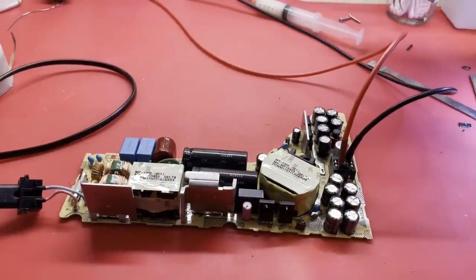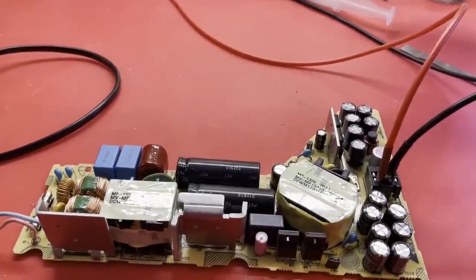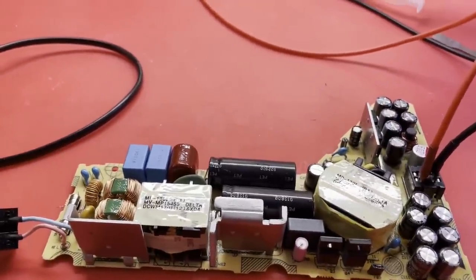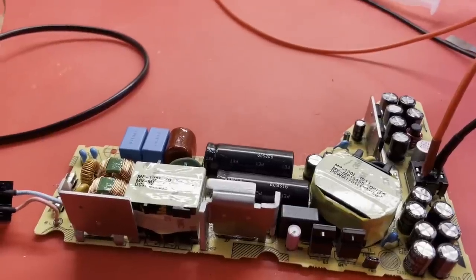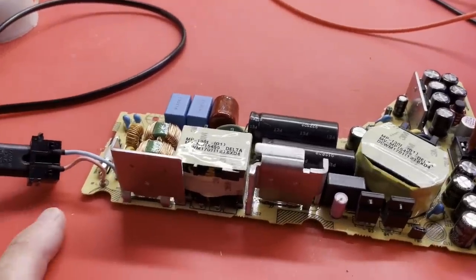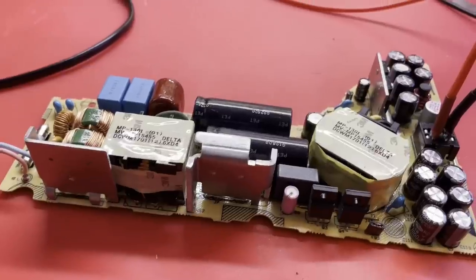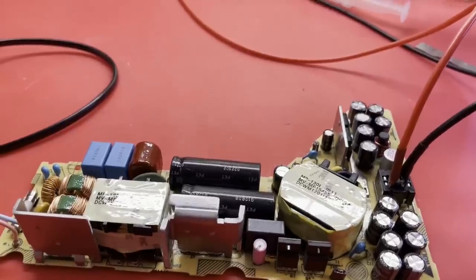All right, well, we have replaced the DAP-53. We've replaced an 8.2 volt zener diode, and we have replaced the 2N7002 MOSFET. But have we got everything? I hope so. The fuse was not blown. This fusible resistor was not open. These MOSFETs seem fine. Didn't find anything else bad, so maybe that's all.